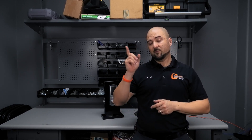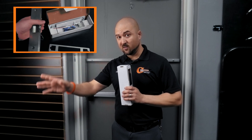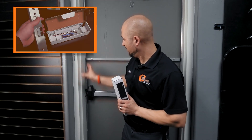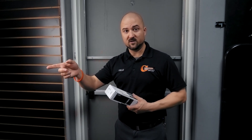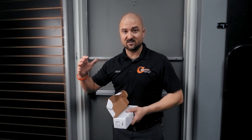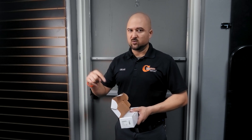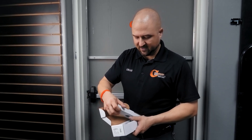I'm going to show you two different styles — first a surface mount strike and how it engages with a panic bar, then take you up front to show the whole wired-in system. Surface mount strikes are the most common type. The frame-recessed ones come in all different models, shapes, and sizes because there are different cutout sizes for different plates, whether it's a wood door, wood frame, or metal frame. Almost all of these can be switched between 24 and 12 volt using different pigtails.